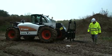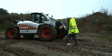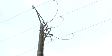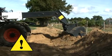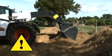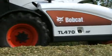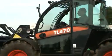A walk around the work site allows you to see the conditions you will encounter during operation. Check for overhead power lines. Contact with electrically charged wires is dangerous and will result in serious injury or death. Excavations, slopes, drop-offs, underground culverts, loose backfill, and fuel supplies stored on the work site need to be identified and avoided or dealt with properly.